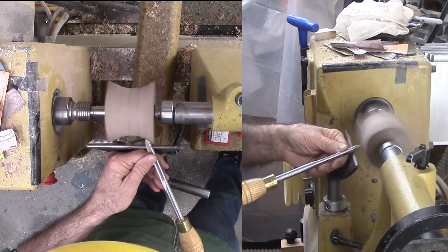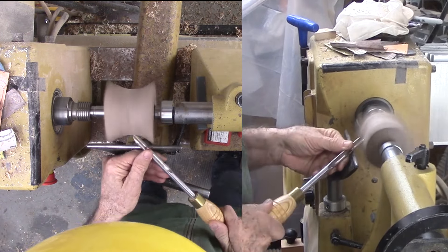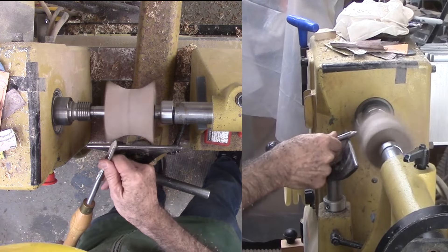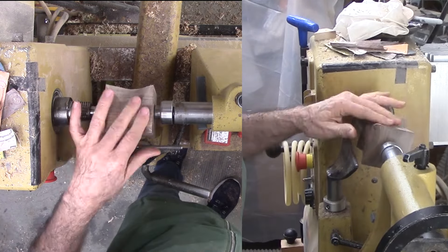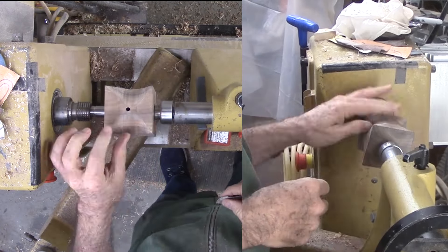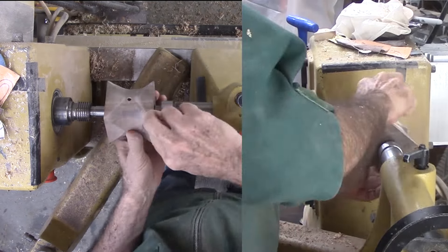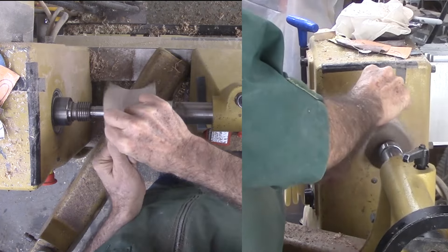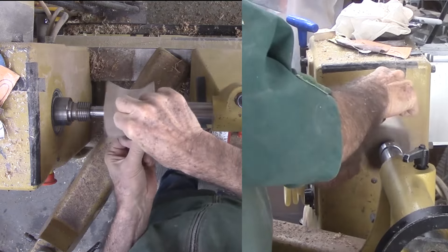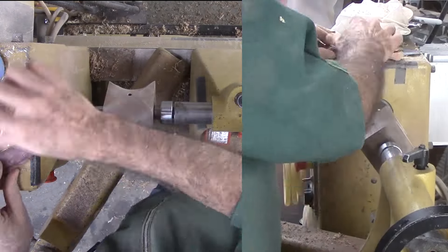This time, at least, there is no benefit from cutting into solid wood. When I am happy with the cove, I switch to 80-grit sandpaper. I am using a narrow strip of canvas-backed sandpaper so that I can hold both ends and let the middle of the strip do the work. 80 grit is the most important grit to establish the smooth curve. The rest of the grits get rid of the 80-grit scratches. I also sand at moderately high speed.